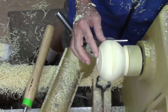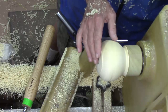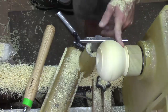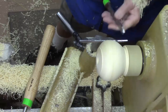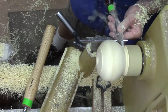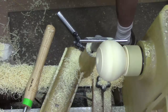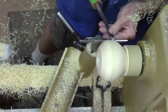Let me look at that form. I think that's close to what I want — I want to bring this in a little bit more and round that off. Since we've got a flat glue surface, I'm going to part it down just a little bit more to give my eye something better to aim for. I don't want to go too far because I want maximum stability at the bottom while I'm hollowing.